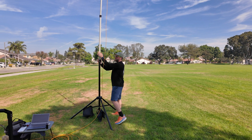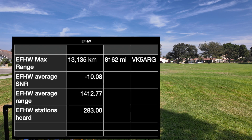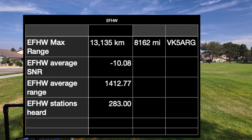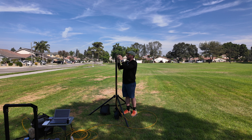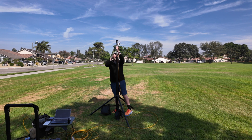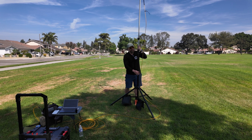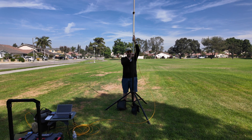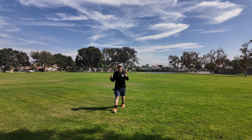I'm going to bring this down and switch over to a random wire. Let's talk about the findings. The NFED half-wave performed quite well with a maximum range of 8,162 miles to VK5ARG. 283 stations picked me up with an average SNR of negative 10 and an average range of 1,400 miles. The transformer is a little warm — not that hot, but a little warm. Tests like this are sometimes difficult because when I switch antennas, the atmospheric conditions are going to change, so the numbers are not 100% accurate — but it's a close enough benchmark to get an understanding of how these two antennas perform from a transmit point of view. We did a quick adjustment, switched to the random wire. The only downside — and there are a couple more I'll talk about at the end — is that you're going to need an antenna tuner to make it work. So I'm going to attach an antenna tuner now to my 705 and we're going to tune it up.